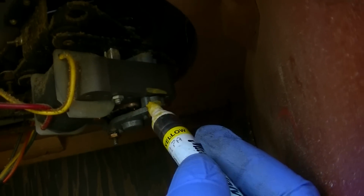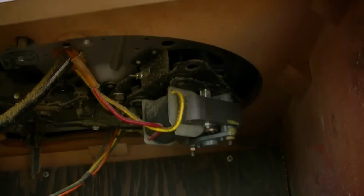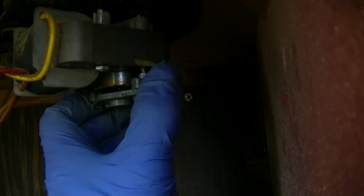That's how you reverse fans. When these motors are used in refrigeration a lot, you want to reverse the fan direction. You flip the core over. I know this is not the optimal way to do this, but I'll get this. This one is so dried grease it doesn't even want to come off the shaft.